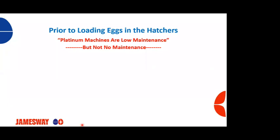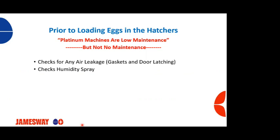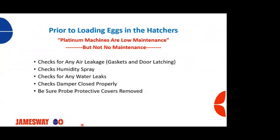Prior to loading eggs in a hatcher, again, maintenance needs to go and check for any air leaks, check doors, gaskets, check your humidity sprays, check for any water leaks around the ECUs or anywhere else. Again, want to check our dampers to make sure that they're opening and closing properly.